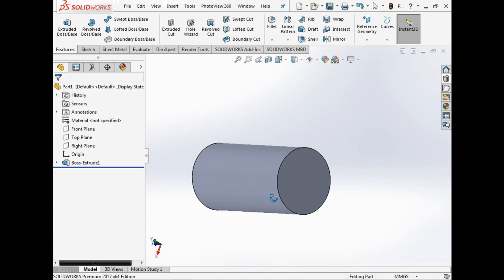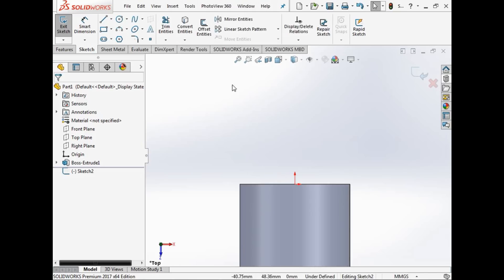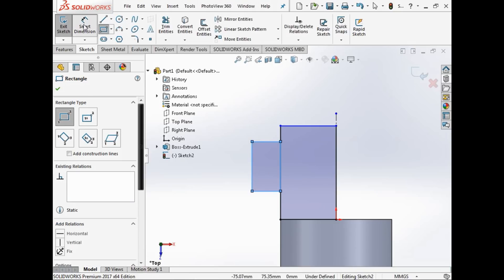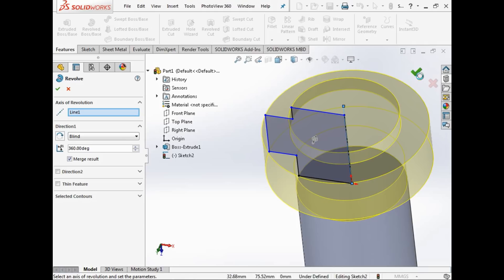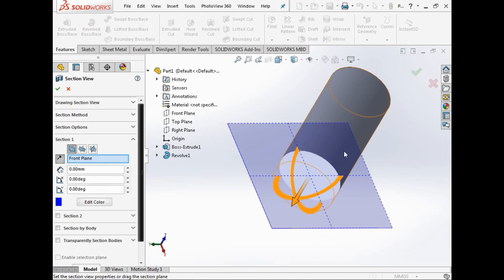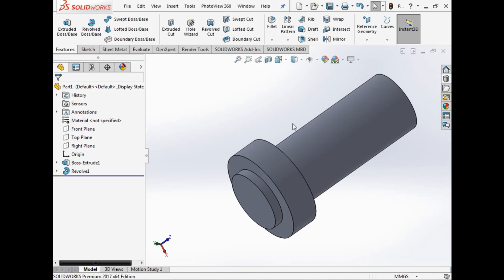Now when we try to do revolve bosses, what happens is we can revolve a shape — in a sense it's like turning but the opposite. When we do this we basically just cut and get rid of material to get this shape. When we revolve something we can't really make alterations to the profile; it has to be symmetrical across all planes generally. So the cross-section is the same at either end.